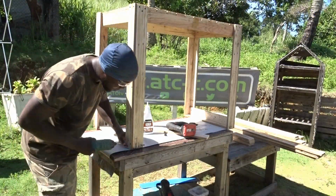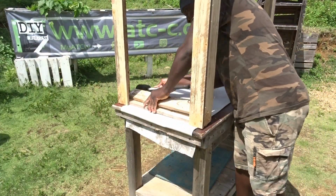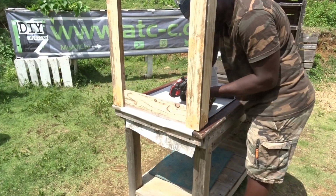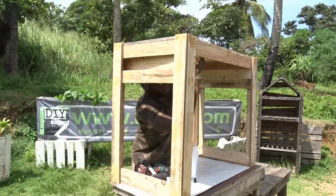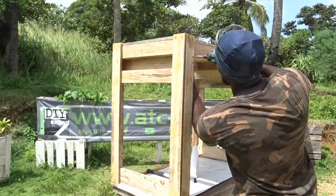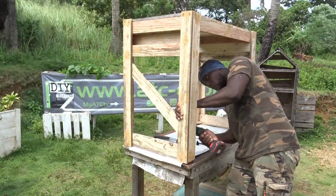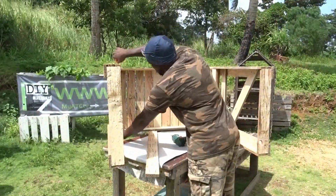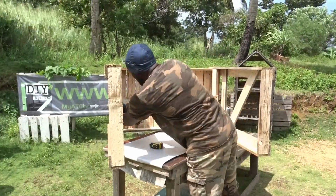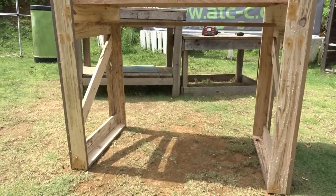And remember the different 50 cm slats that I showed you a few minutes ago that I was cutting with the wood left over? I will be adding them at the bottom and also on the side, on the top, in order to add a little bit more stability to the table base. And the last slat, the long one that you can see here, I'm adding it at the middle of the bottom of the tabletop actually, in order to make sure that the legs stay in place and don't move too much.